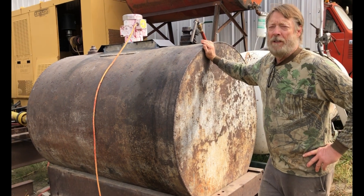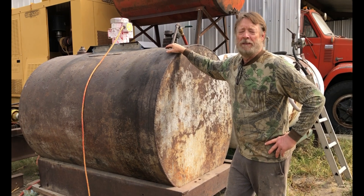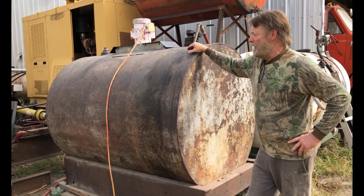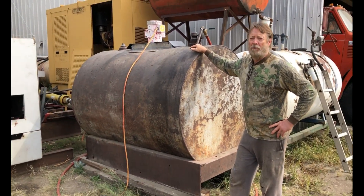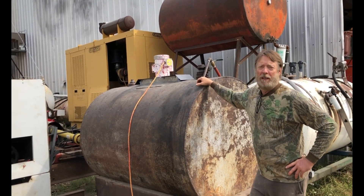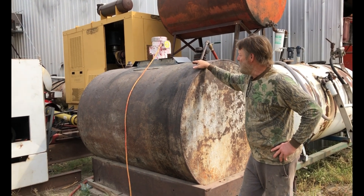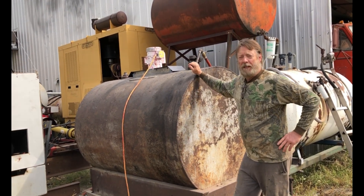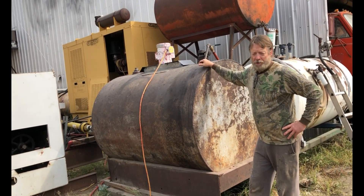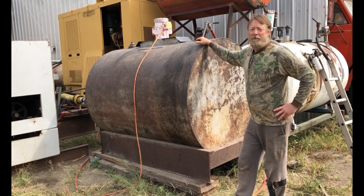Back in the 80s I was reading online and there was lots of testing done with vegetable oil without any solvents — they just wanted to see what ratios they could run. The bulk of the studies I thought were done well suggested up to about 50% worked pretty well. Above that, it starts getting too thick and really starts coking things up. I'm starting at 50%; I've run it up to 80% in the past a few years back.